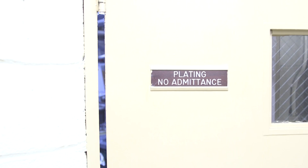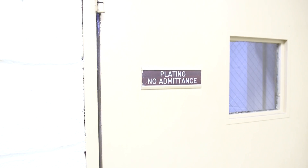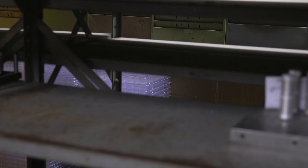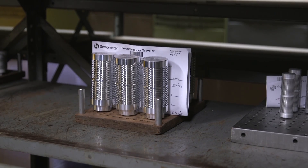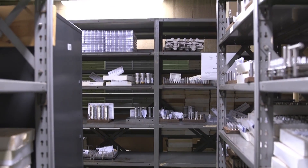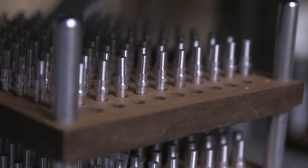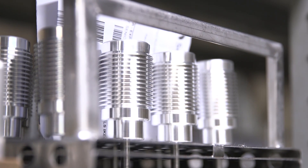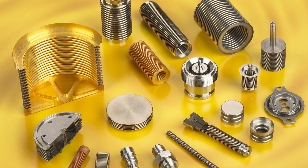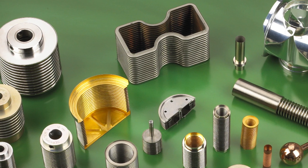The precision mandrel is then delivered to plating — as they say, this is where the magic happens. We employ a proprietary plating process that is capable of delivering exact wall thickness less than 0.01 millimeters. Our proprietary Flex Nickel is our plating metal of choice. This unique nickel cobalt alloy features exceptional tensile strength and resiliency. It outperforms alternative nickel alloys at cryogenic temperatures and minimizes leak rates. Other metal choices are copper, gold, or silver, depending upon the application requirements such as conductivity and media compatibility.